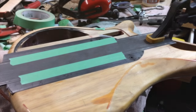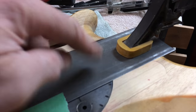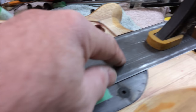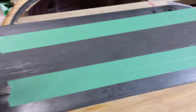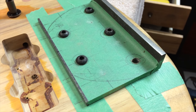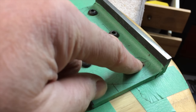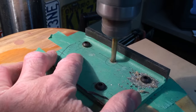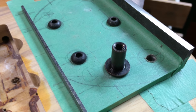I'm all set up here, ready to drill the bridge holes, and I've got the middle bar clamped in place because there's nothing holding it. I don't want this thing shifting back and forth as I'm drilling those holes. A little bit of tape as well. And I put the bridge in place, just as a guide, really, to keep these holes as straight and accurate as I can. So I'm gonna start here. I'm gonna drill this one, move the screw over, drill the second one, move the screw over, that kind of thing. And then I've gotta widen the holes on the back for these guys,